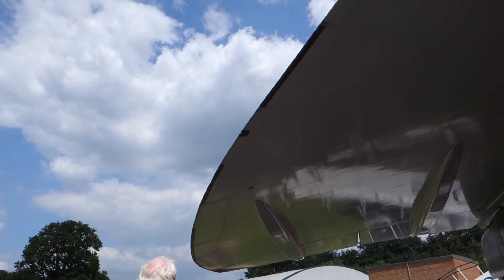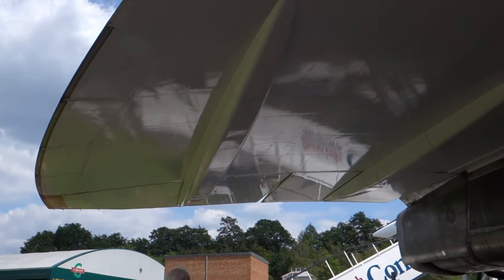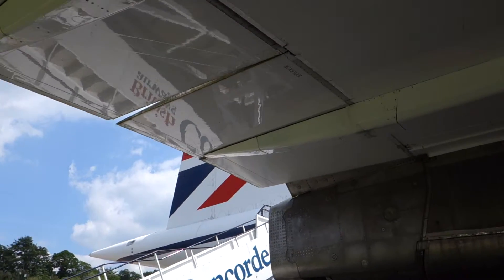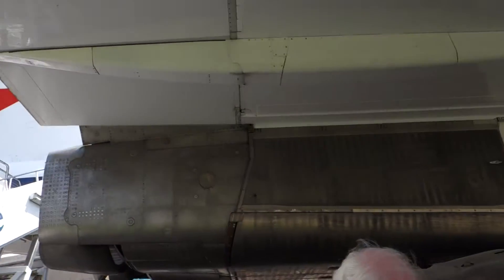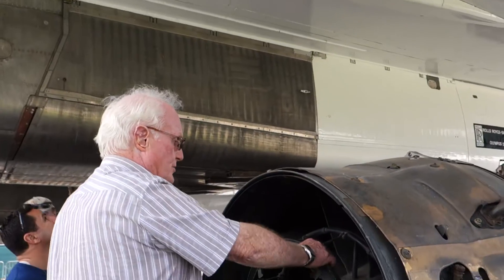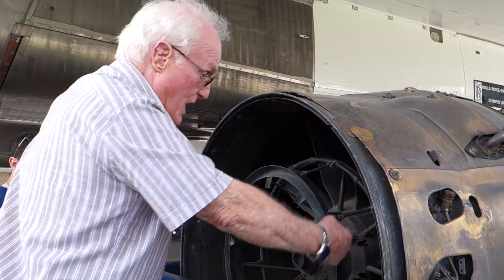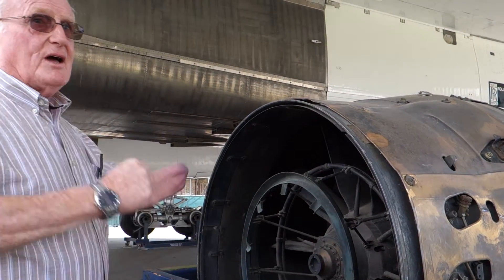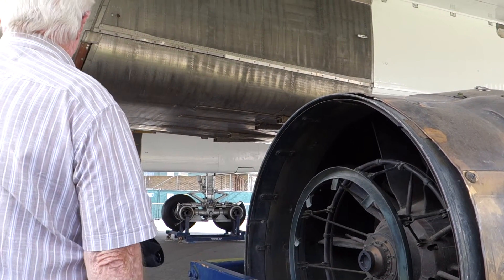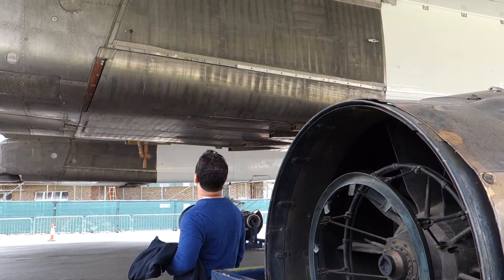Come this way now. Just a little thing while we pass this — you look at the back end here and you've got the afterburner ring. We inject another 5 tons across the ship. You've got 1,250 degrees inside there, so if you put more fuel at the back here it will catch fire, and thus you'll get another 25% of thrust. That's why the eyelids are slightly closed when you've got the afterburner in operation.